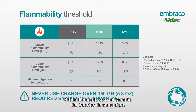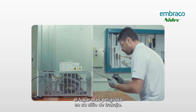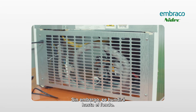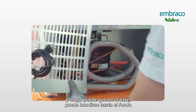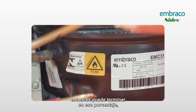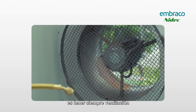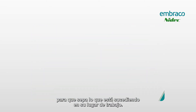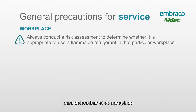The inside of the cabinet is probably the most dangerous place on your job site. Remember, R290 is heavier than air, so it's going to sink to the bottom. If you had a leak inside that cabinet, it may be at a dangerous percentage at one point, then sink to the bottom, and when you open the door you may end up in that flammable range — though ventilation may blow it away. The most important things are to always have ventilation and always use your hydrocarbon gas detector so you know what's going on at your work site.